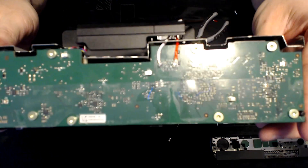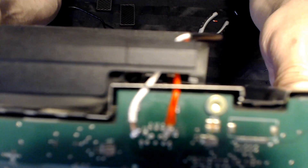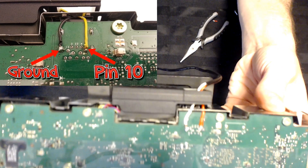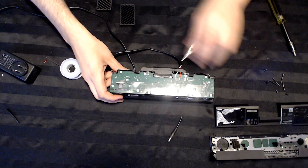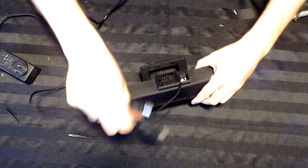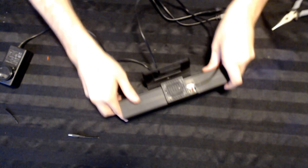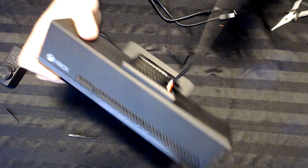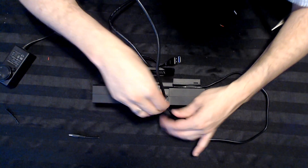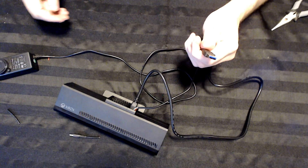We've got these soldered on now — it's not looking real pretty, but I'll show a closer picture of what it's supposed to look like. Let's get this thing put back together, just replacing all the pieces in reverse. Now that it's all back together, you can see the power cable is coming out like that, and we still have access to the USB port. These two together give us USB for data and 5 volt power from the USB, plus the 12 volt from the power adapter. Let's give this thing a shot.